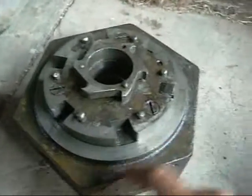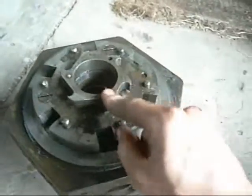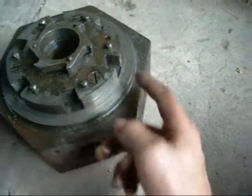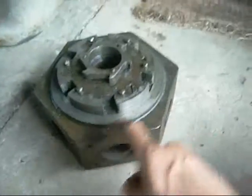That's the underside of the turret. I've given it a quick clean because it appears to have been greased at one stage, presumably when it left the factory — I don't think this has ever been apart. Obviously that's where your turret lock goes in and locks it between stations. That's what rotates it, and that's a turret bearing.